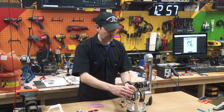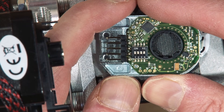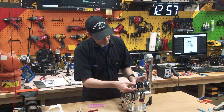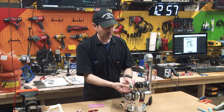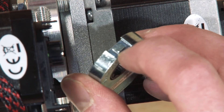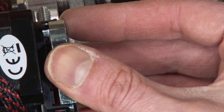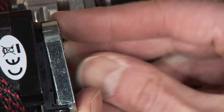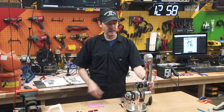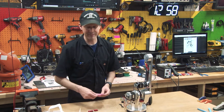So that's on, the panel's mounted, it's in the right orientation, and everything's aligned to the shaft. Now we take one last look at our switches and make sure that we're off, off, off, on for one, two, three, four — that gives us our 512 steps resolution. Now this has a couple little clips on the side and one up here — they all have a ramp to them. Just align that up over there and push it on, and it'll just engage. And you have now installed a fabulous encoder for the J3 motor. That's it — it's that easy.